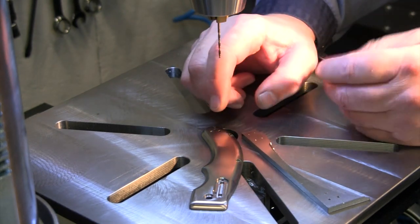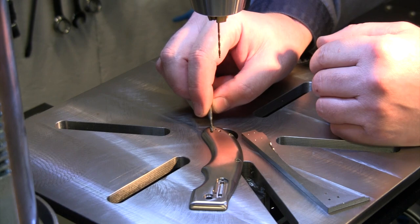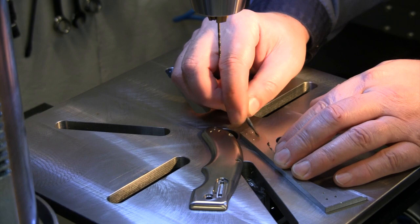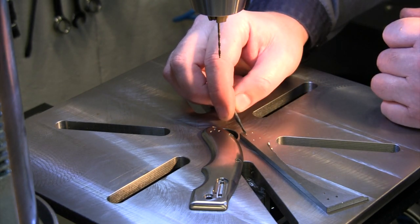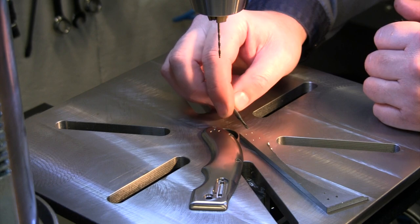But first, since this tap cut so well in these holes that were not drilled oversized, what I'm gonna do for today is drill two holes with the standard number 50, and I'm gonna drill these two oversized at 5/64s. We're gonna put the Tapmatic back on here, and first we're gonna tap the ones that are oversized, make sure we've got the Tapmatic set up.